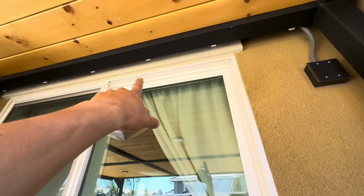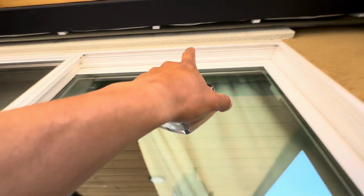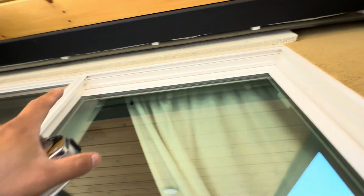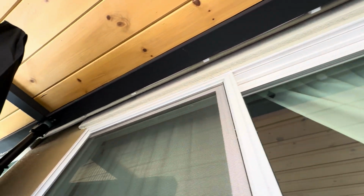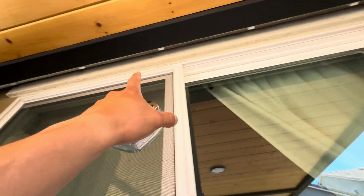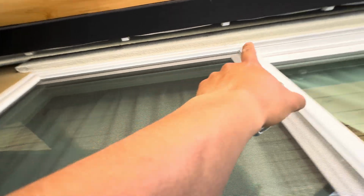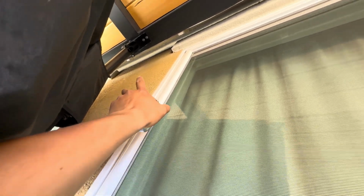So I've got to cut that pipe back. I was planning on doing a back-to-back 90, but my pipe-to-pipe fitting is going to end somewhere there, and I'm not going to have space to get the fitting on or get channel locks and tighten it up. So what I'm going to do is just cut it short to 6 feet and do the fitting right there. That pipe's going to be a full length, no more fittings up there, and then the outlet's going to be somewhere there.